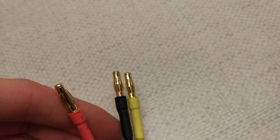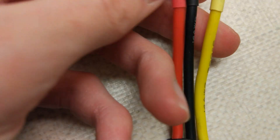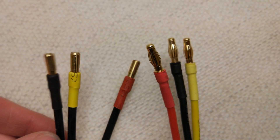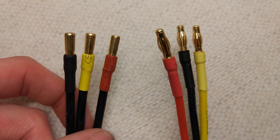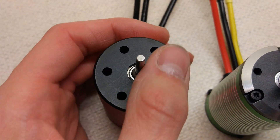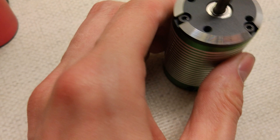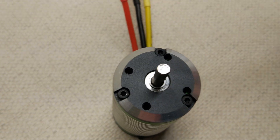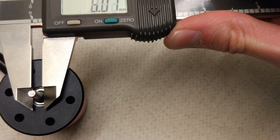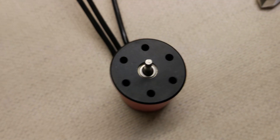On the X-Team, the wires are silicone, 14 gauge — so that's pretty nice. But it does have banana connectors, and I don't like the banana connectors as much as bullet connectors. Also the wire colours are in a completely different order between the two, which is quite funny. The Surpass one has six M3 mounting holes while this only has four, so if you need a specific mounting position the Surpass one is probably better. Let's check the shaft diameter: the X-Team is bang on 5 millimetres, which is good. The Surpass one is 3.17mm — I think it's supposed to be 3.175mm — but it's close enough.